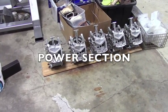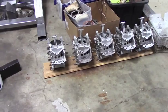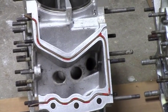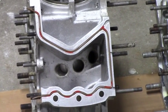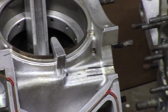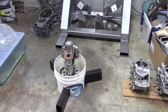We're about ready to reassemble the power section. There's all the cylinders ready to go. We've got the connecting rods and pistons all put in each cylinder. You can see there's a little seal in between each cylinder section. Originally it looked like it was a molded-in piece of rubber. We went ahead and used a 1/16th Viton O-ring and put it in, then used a little dot of RTV to hold it in place. We got each little oil squirter put in, including the two replacements we built. We'll put those cylinders on a little stand using a bucket to hold them as we set it in there and start reassembling.